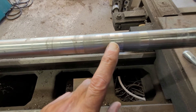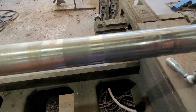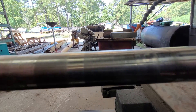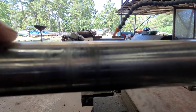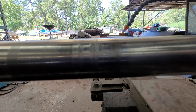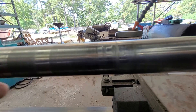It's got some big grooves in it. The new seal rides in this area and this area. The old rope seal rode right here in this area. These are grooves — one, two, three grooves where apparently the rope seal has moved a few times. Three grooves where that rope seal had been sitting, the packing lands.